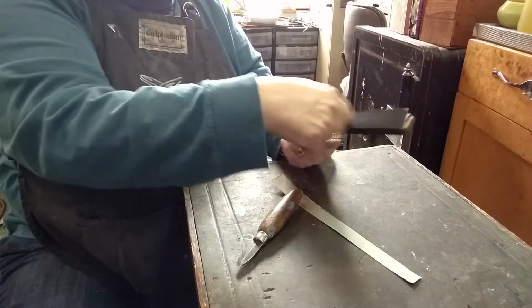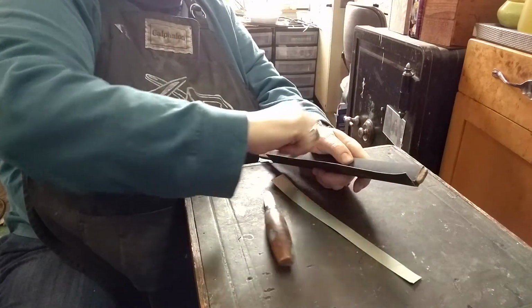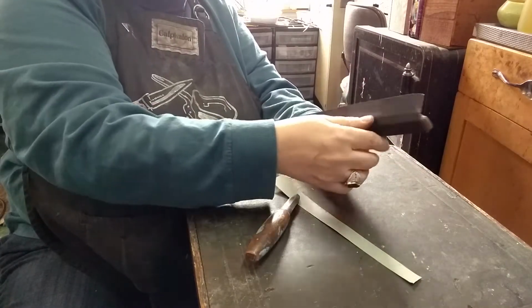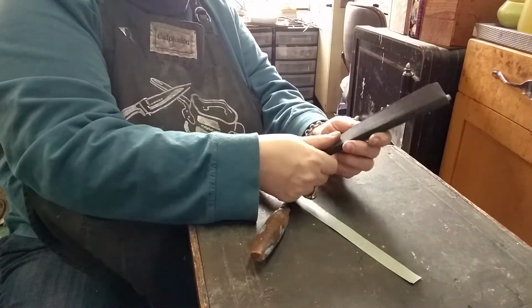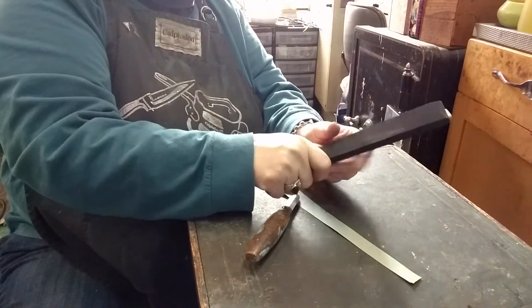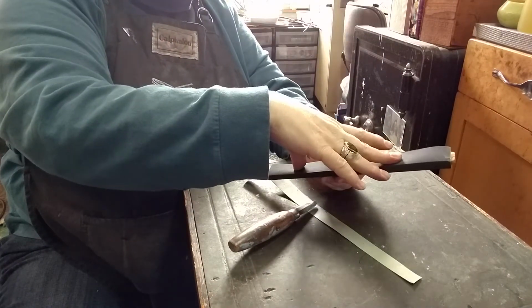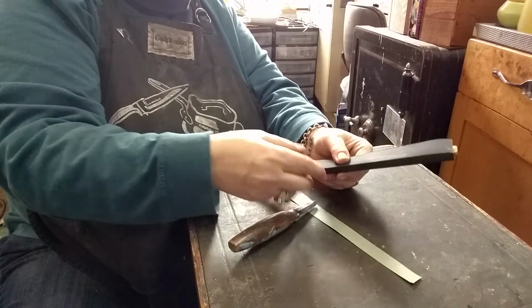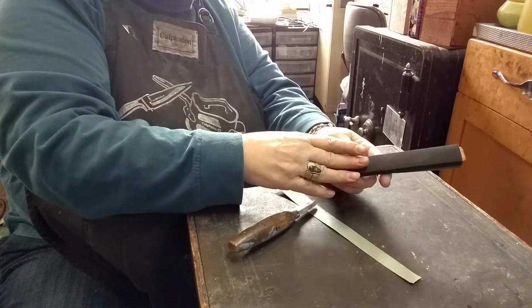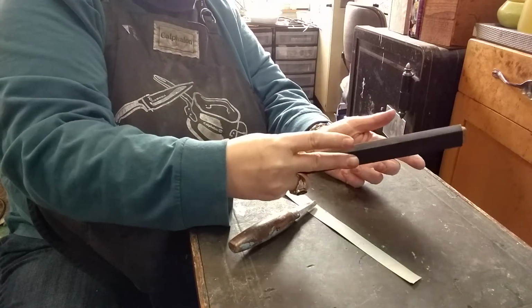And every time I use up one face, then I can just go open it up a little bit and score right along there and remove one piece and still have 3 nice sides. As you start to work it right now, obviously, because it's brand new, both sides are the same. But as you work it this way, every time you tear off a section, now you're going to have fresh emery underneath of that, and you're going to have a slightly older emery on the other side. So you effectively have a coarser and a finer in hand every time.